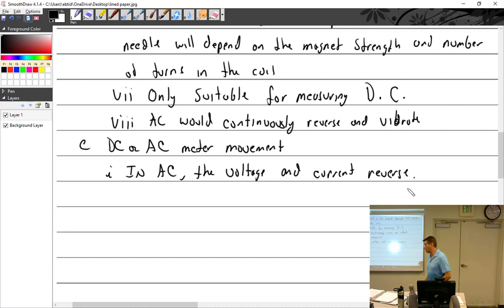You're not held responsible for it now, but when you add a coil to an AC circuit, a coil has properties that fight what's coming through. We refer to it as ELI the ICE man. So coils are L for inductors. That means the E, voltage, is first, and so the current lags.